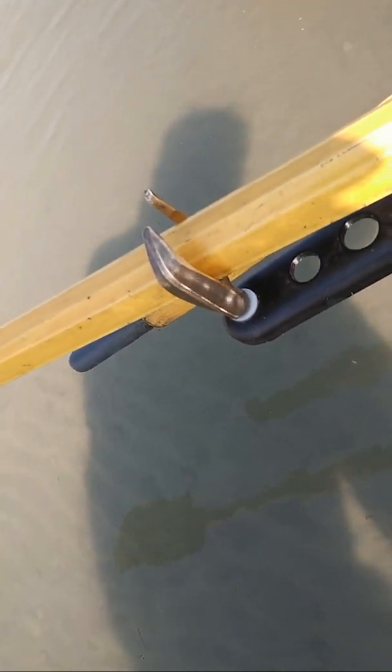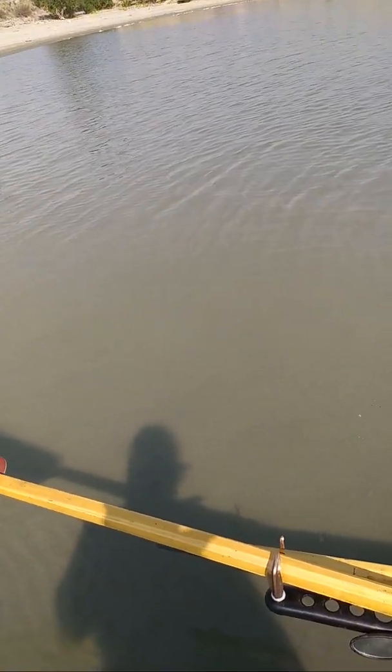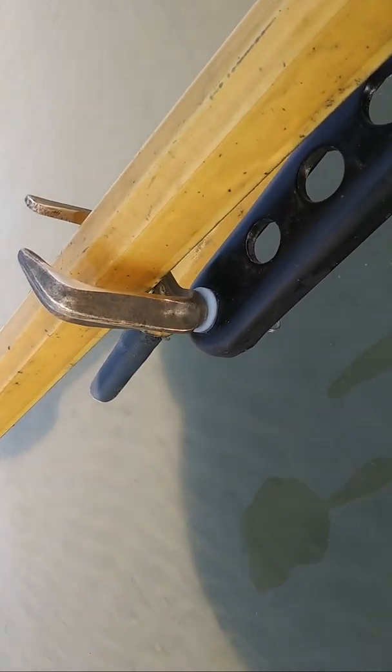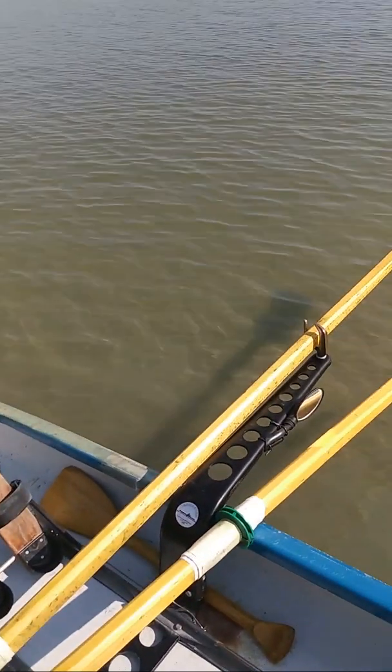And I talked to Karen at Adirondack Rowing back east there, and they do supply, in fact they supplied the bushings I have, those white nylon bushings. They have replacements for this boat, and they got some of the new style composite oarlocks as well. At some point I'll probably get some. Anyway, getting off track here, she said they don't generally grease or lubricate their oarlocks, and so rather than keep adding lube every single time I row, because like I said, it seems to have turned on me and started getting sticky, I've cleaned it completely off, and this is an experiment.